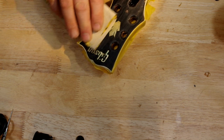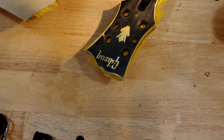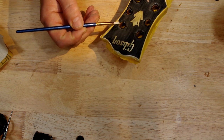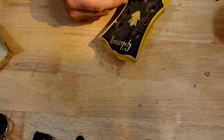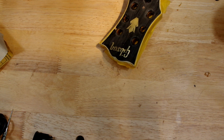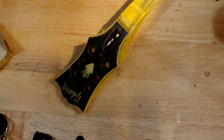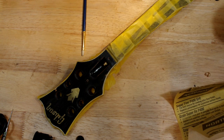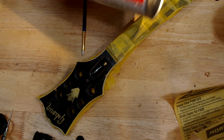It will not weld into itself, so I'm creating a capacity here for a mechanical bond by sanding on that vinyl sealer a little bit, and I like to use a little finer grade than they recommend. I go with about a 400 grit sandpaper when roughening up that surface. It's worked okay for me.